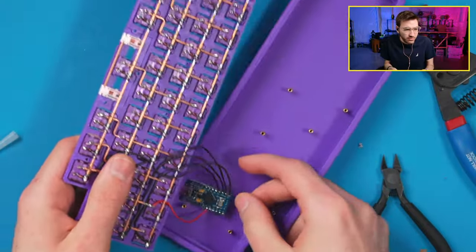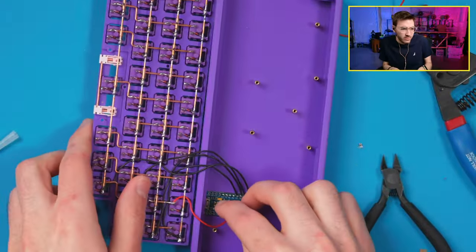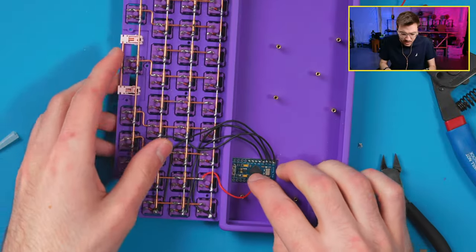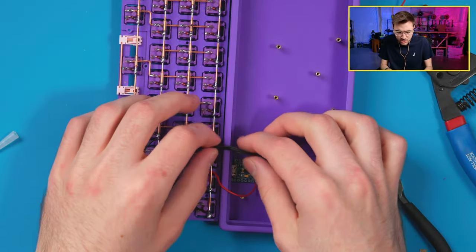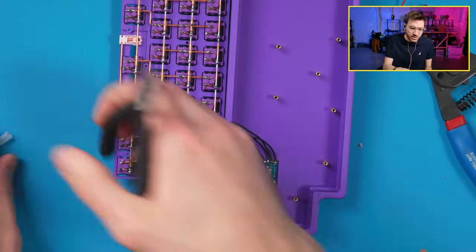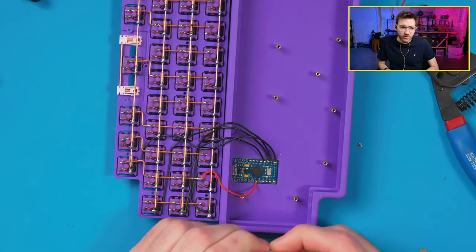Have you built wireless keyboards? Done it with ZMK and NRF, but without the batteries. Battery switches are painful for me to solder for some reason. I have done wireless boards. I don't do any switches on them. I don't do power switches when I do wireless. I just use a deep sleep function within ZMK firmware.